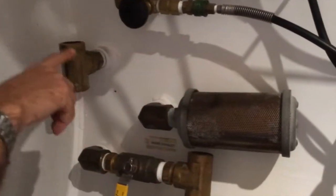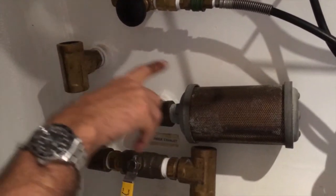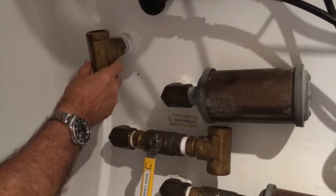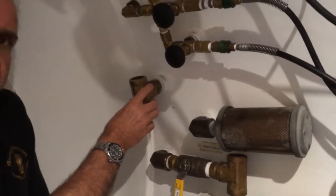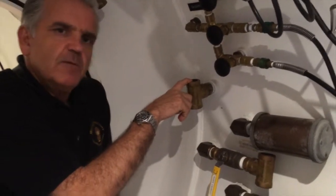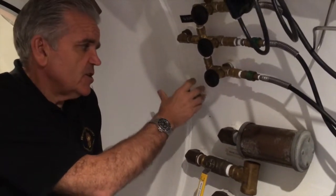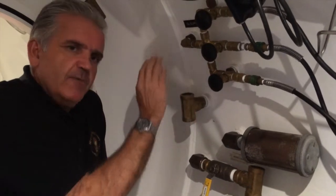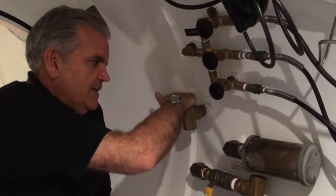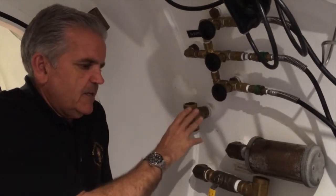When you vent the chamber, you can tell what I'm talking about when we want to hold the vent for at least 30 seconds — we're only getting a very small amount of circulation here. Typically we like to take this exhaust and run it under the deck plate as we do it in DTC 2, but you are going to see chambers like this plumbed this way in the field. Be very aware of this exhaust T when we are exhausting the chamber. If you are out in the field and you see an exhaust that just has an open-ended pipe fitting, that represents a serious hazard for a differential pressure injury. You do not want to cover that up. If you were at depth and somebody opened that valve, it would literally want to suck your hand outside that T.